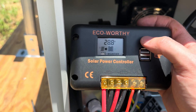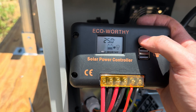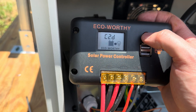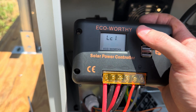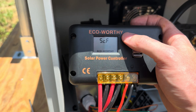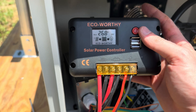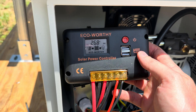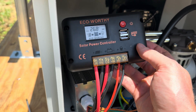Going through the other settings — these are defaults I didn't change. C2 day means it will run two hours during the daytime then turn off for 30 minutes to charge. PON I also didn't change. The one you do have to change is SCN — by default this causes an O4 error where it triggers on high voltage when the pump kicks on. You have to change that setting or you'll get the O4 error.